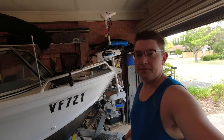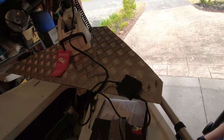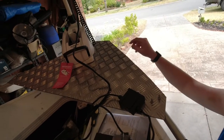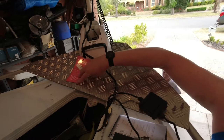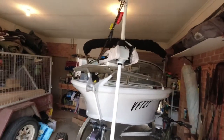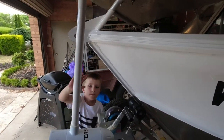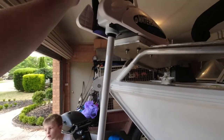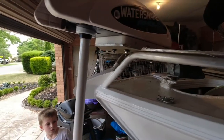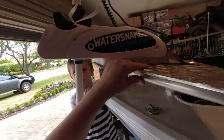So I'll show you exactly how I've got it mounted up. As you can see, it's just the five mil plate cut angled. Like I said, I need to put in a little bit of steel under here because there is a little bit of flex which I'll need to take out. Around here you can see there's plenty of room - it's not going to hit anything. I've still got plenty of room at the top for the motor to make sure it's in the water and not hanging out too far. I've just put two lots of U-bolts on to stop it - I don't have the front ones on because I'm just trial fitting everything.